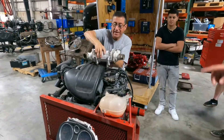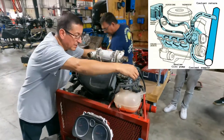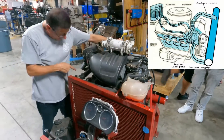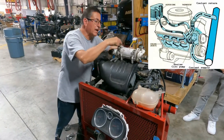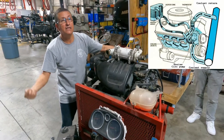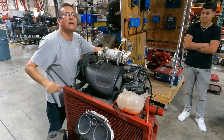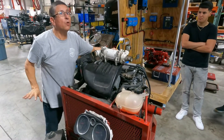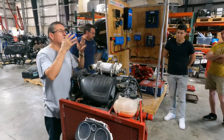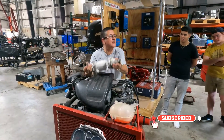The most common and famous is the heat exchanger for the coolant. The coolant enters and returns — it's a closed system. The seacock valve brings raw water in, the raw water passes through and goes into the exhaust pipe. Seawater is the cooler here. The coolant never touches the raw water. That's the heat exchanger.